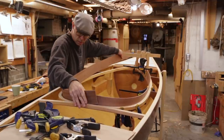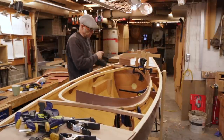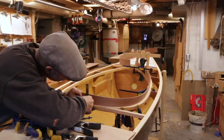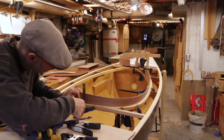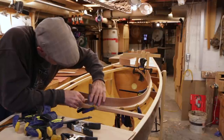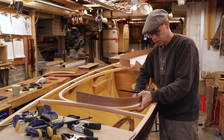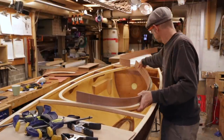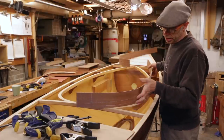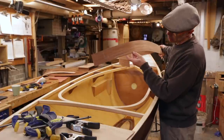I'm going to try and get this out gently. I wish that held its shape better, but I'll talk about that in a second. I'm now sitting about three-eighths of an inch higher than I was when I initially bent this in place — I think the attitude of it is better, so I'm kind of glad I went for a second shot at this. When I release this I'm putting a thumb in here just to hold that tension, because if it's going to spring anywhere I don't know where it's going to happen. Okay, that's a fair bit of spring back, much more than I would like. This wood has just got a hard kiln drying and it's just not wanting to yield.